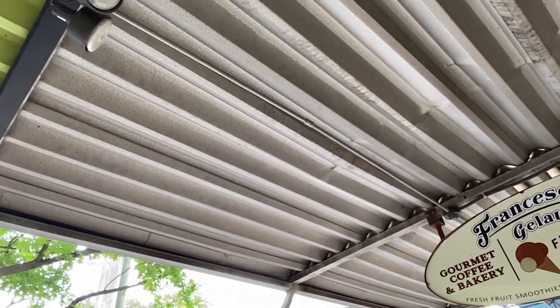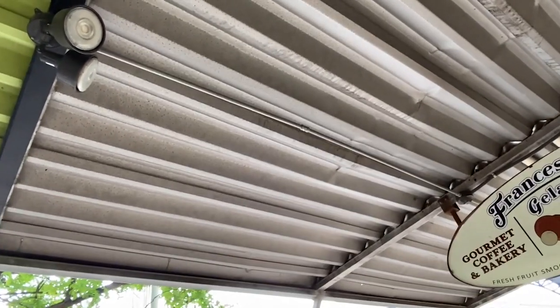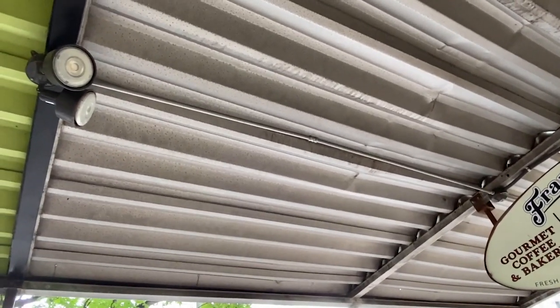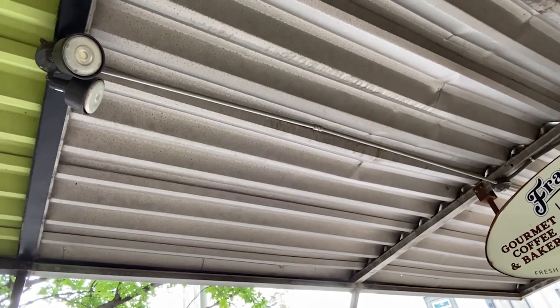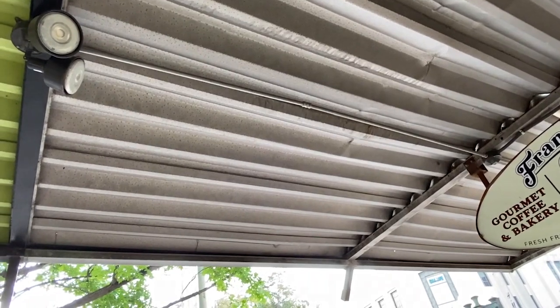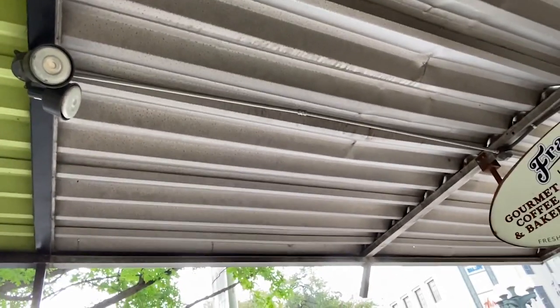But here I don't see any clips — not one — so it's sagging quite a bit. That's going to put strain on the connectors and the couplings. Also, can't be 100% sure, but we may also have a violation of section 300.4E. It looks like that raceway could be closer than an inch and a half to the bottom of that corrugated metal roofing.